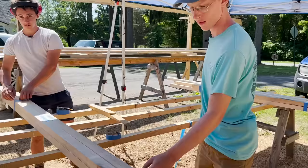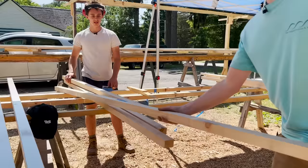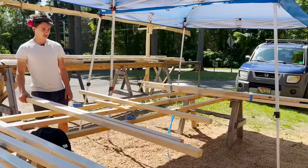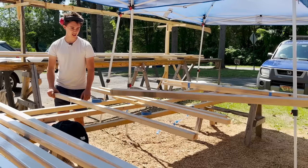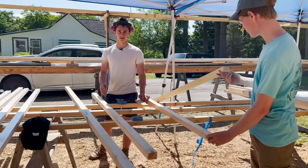What we need to get here is a 26 foot plank, and we don't just have those lying around. So all of these pieces here add up to a few feet over, because we lose some distance during the scarf, but we need to get all of these put together to create the larger plank. So these pieces, Steve went and arranged so that all we have to do now is put them together, because they already meet the desired length.